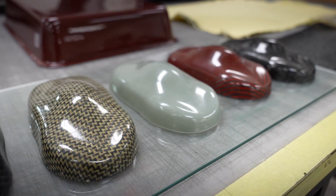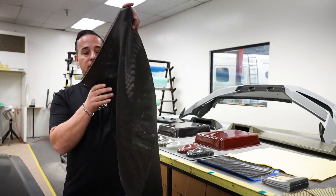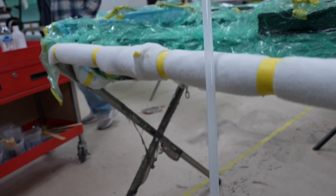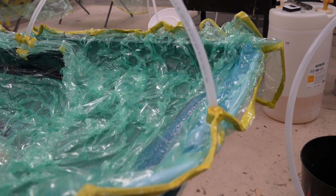On carbon, there are different types. Some people do full carbon parts, some people do fiberglass inlay — we only do full carbon parts. We do two techniques of carbon. We do what we call infusion: you lay the dry materials that come in sheets, then you put it under vacuum and vacuum bag it, and then you infuse a two-part epoxy resin through it. That's how you wet the material, but it's still under vacuum and keeps it light.